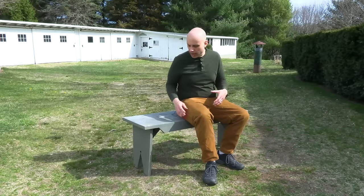I think the construction is optimized for the way hardware was changing. By the 40s, cut nails were getting harder to find and maybe very expensive, so they just had to make do with what was cheaper. If you don't have nice square-sided cut nails and all you have is skinny little finishing nails, well, this is the style of bench to build — because it works with the materials and hardware available. Craftsmen have been doing this for centuries, constantly adapting what they do to what's around.